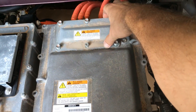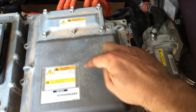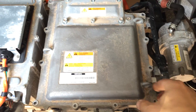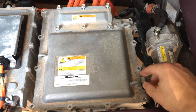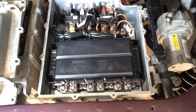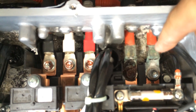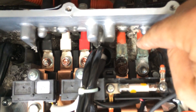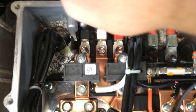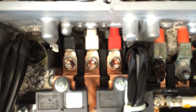I pulled the little cover off to see the connections underneath. Here are the guts of the electric motor controller. Looking close up, you can definitely see some corrosion, particularly on the battery cables. There's also some salt that dried and was left after the seawater was in here — on this side as well. On the left, these are the three connections for the three-phase power to the motor, and those look pretty good. The copper bus bars all look nice and shiny.